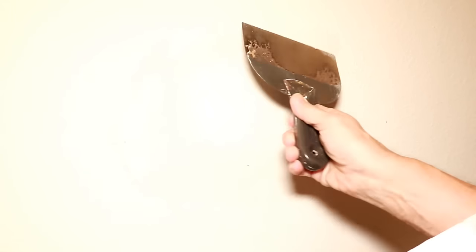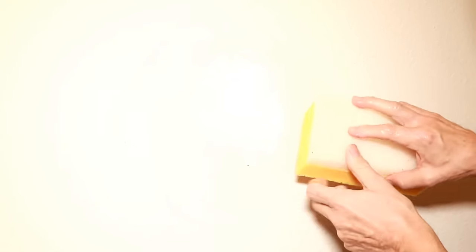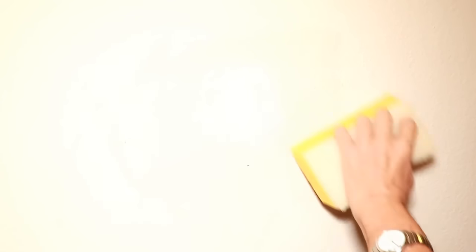Do the same procedure between the same studs about four inches above the floor. If there is no cross member, then you just need to do the inspection near the floor. Be sure to do this for all the studs in each wall of the house. To repair the holes, get a couple of cheap broad knives and some spackling compound and simply fill them in. Be sure to feather them out as best you can, let it dry overnight, then lightly wipe it down with a damp sponge to remove any excess spackling compound.